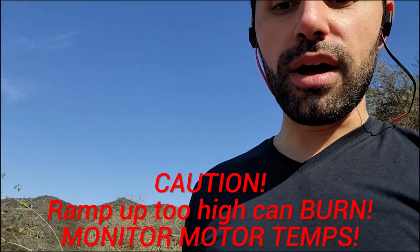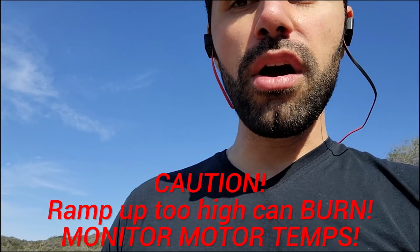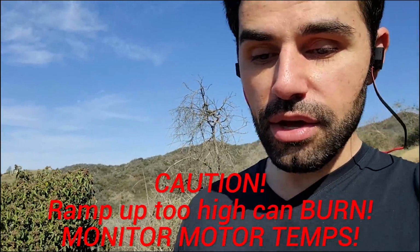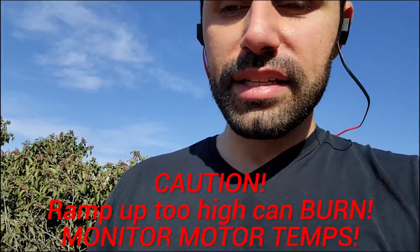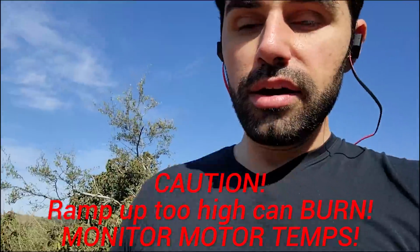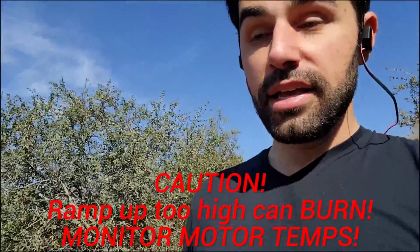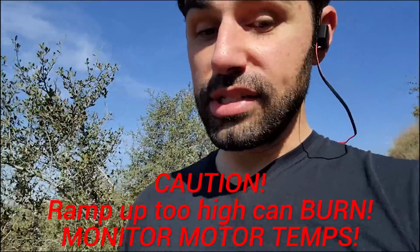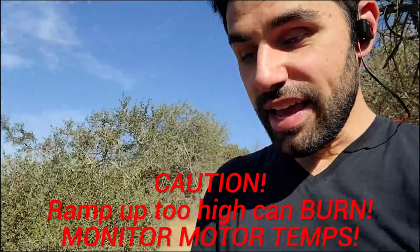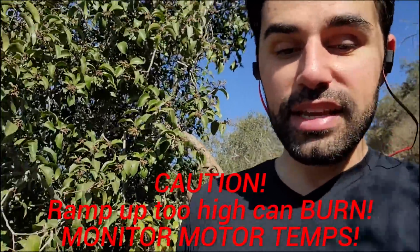On my own 7-inch quads, I increased the ramp up power, and the overall response to the PID loop and the response to everything that was happening on the quad improved drastically. Even the throttle pump issue is drastically improved on Betaflight and EmuFlight, no matter what you're running. So if you're running a Cinelifter rig and you're dealing with a hefty quad that is lifting something that it really doesn't want to lift, you could find some pretty significant improvements.